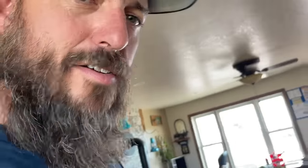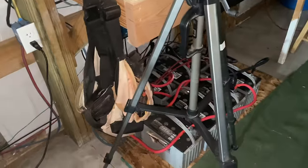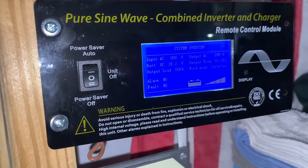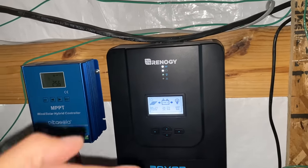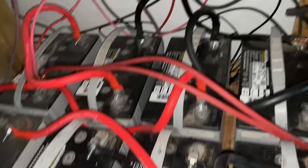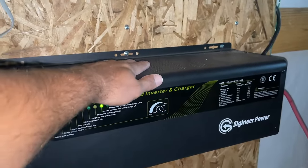We're gonna go back out to the shop and see where our load rating is. How are we doing out here? 26.2 DC volts. Still only at six percent output load — has this thing even been loaded yet? Battery bank: we've got 725 watts coming in now because the sun is getting closer to the panels as it rotates. That's a nice 26.4 amps. Cables are not hot. Inverter humming away, doesn't seem hot.